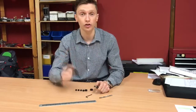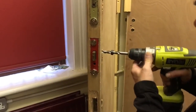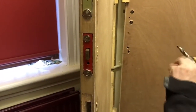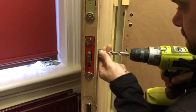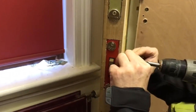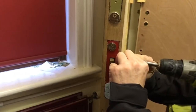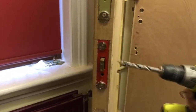I'm going to pass you over to Peter, my engineer, to show you in practice. As you can see, he's drilling the lock. Once it hits the lock casing, he's going to stop drilling and slide the drill bit collar up to the edge of the door — this tells us the distance between the lock case and the edge of the door. We loosen it up, the drill bit touches the edge of the case, slide up, then re-tighten it making sure the grub screw is in the groove so it prevents slipping.